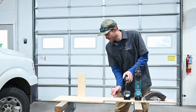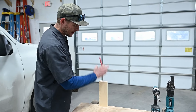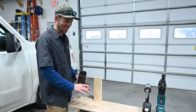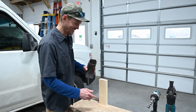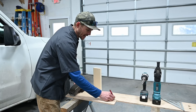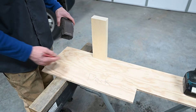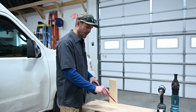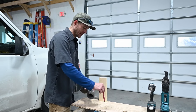The wall, we'll just imagine, is over here. I have the elbow of the same size downspout I'm going to use. Gutters are up above. First thing you want to do is spend some time researching where everything's at under the decking. I've drilled through before and ended up right on top of a joist — it's a bummer. What I like to do is crawl under the deck, get a measurement. Through the deck crack, slide something until you can feel a floor joist and make a little mark.